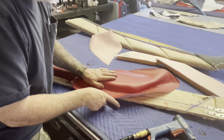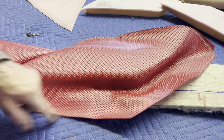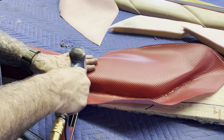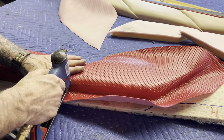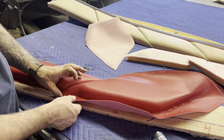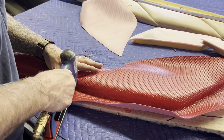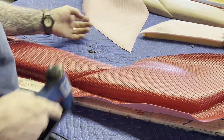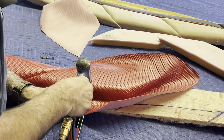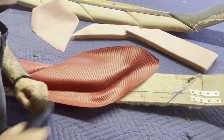And then you come up here and you wanna push it down and keep your staples perfectly aligned. You see that? Keep your staples perfectly aligned. And then look once in a while, make sure, because sometimes they'll ride up at an angle. Nothing's perfect. Human beings make these. And then as you go, you kind of pull back. See that? That's called as good as it gets. See that, how those staples all line up? Boom, boom. Yeah. And then you'll come through like this. Then you'll butt up like that, okay?